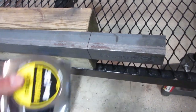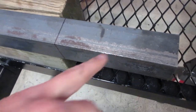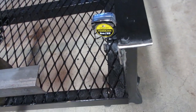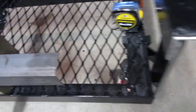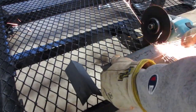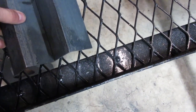Got them all measured up with my power lock. I went one on each side because when I cut with an angle grinder it's not going to be totally straight, so this gives me a perfectly straight side to butt up against. That's probably not perfectly straight anyway, so it probably doesn't make much difference, but it gives me a little peace of mind. Going to cut these two guys off — each seven inches — and see how close I got.